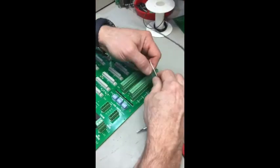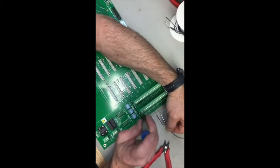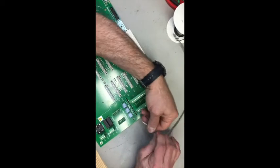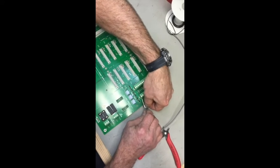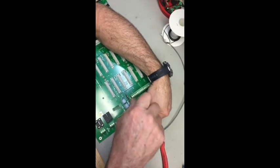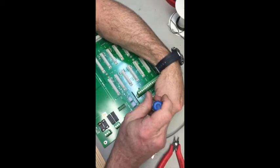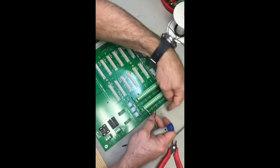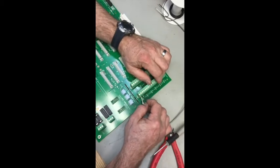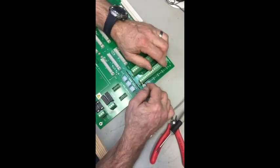To terminate it on the controller side of the smart level, bring it into the enclosure and open up the screw terminals on the terminal block you wish to use. Here I'm installing it in channel one. Note that the center conductor goes into channel one and the ground conductor goes into the ground connection. Tighten this, and note that the ground connection is shared by both adjacent channels, so you may push the next channel's ground wire in separately and tighten accordingly.